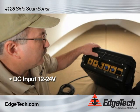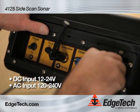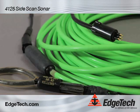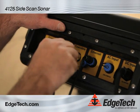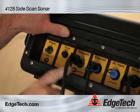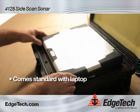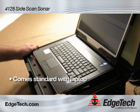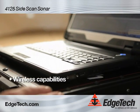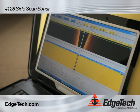The DC input is 12 to 24 volts — anything in between will work. It also has an AC input of 120 to 240 volts. The Ethernet connection is for the data that comes from the towfish. The tow cable connector plugs in here. You can see we have indicator lights for fish power and for topside power. The 4125P system comes with a ruggedized laptop, preloaded with Discover software, coverage mapper, and TargetLogger software. It also has wireless capabilities, which means we can connect wirelessly to this topside so that we do not need to be connected via the LAN cable.